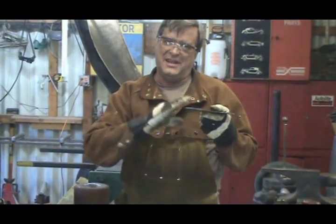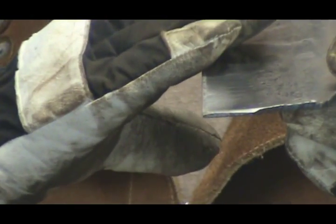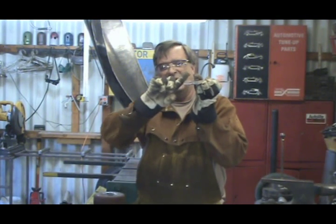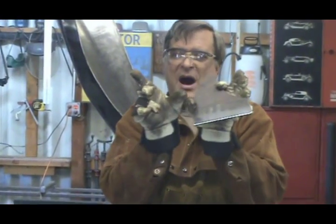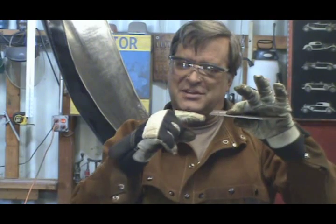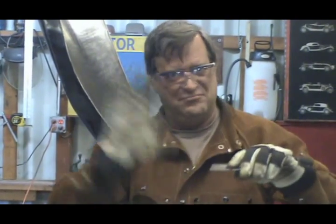And while I was at it, I also put a little chamfer on the edge. Let me get a close-up of that. See this little edge right there? Where I was going flat with the grinder across here, and then I just turned the grinder at a little bit of an angle and just went across it one time just to put a little chamfer. On the bottom of this piece it's still vertical, and then it comes up and then out for the chamfer. So when I butt these two pieces together, I'll have that wider surface at the top where I can put a nice wide bead down inside there so everything will hold together. I'll flip it over and I'll also chamfer this side. So now I've just got that vertical area right in the middle of the metal with a chamfer on one side and a chamfer on the other. Nice weld — never break, it'll hold up just fine.